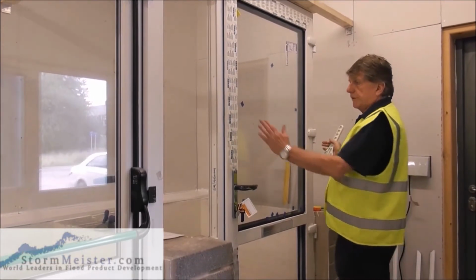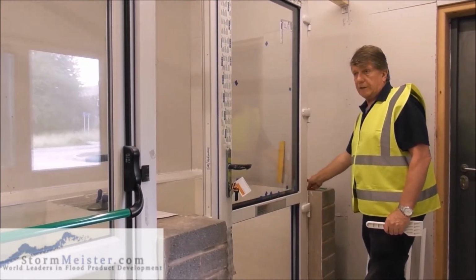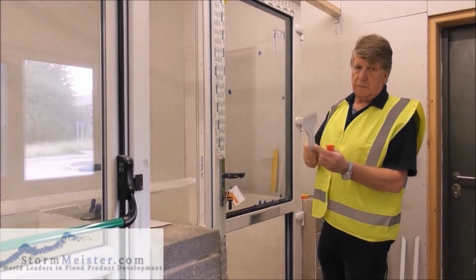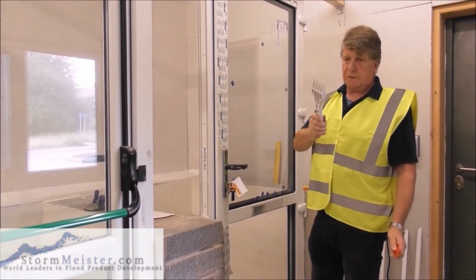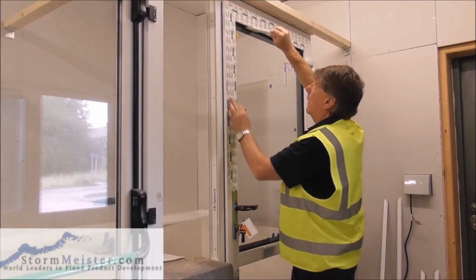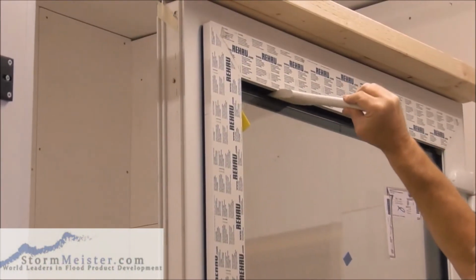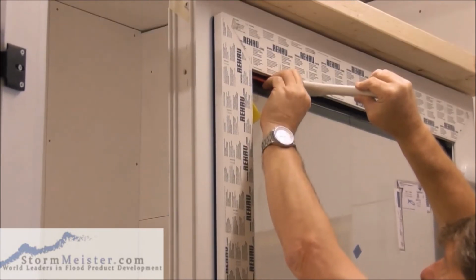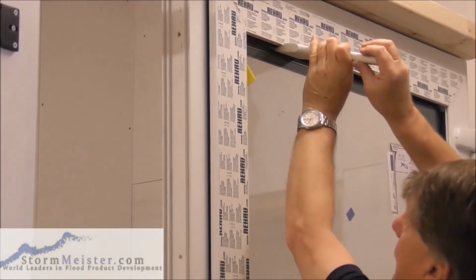Now, as I said before, this sash seems to drop slightly. So the way we would compensate for that is we're going to jack it up a bit. The way we do that is using the glazing paddle, not something metallic, because if we use a screwdriver or a chisel, we'll damage the glass. So we use this plastic glazing paddle. We put that in, and can you see how I can lift the sash? See how it's lifting? So I just need to lift this by about 5mm. So I then put these packers in here, to keep the sash roller braced in the correct position.